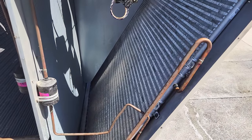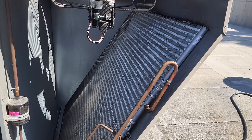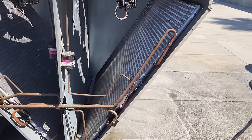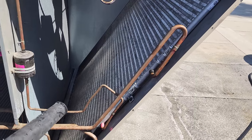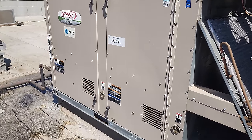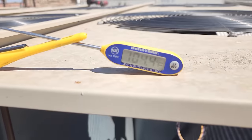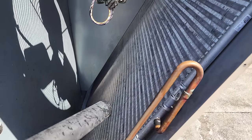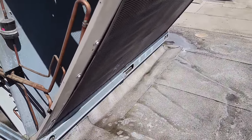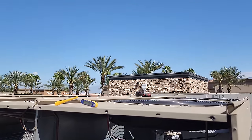Turning the system on with all that water in the coil — it's going to take a while for that water to exit or evaporate. In really hot climates, I've actually seen all that water in the coil trip high head pressure. I know it doesn't make sense, but I've seen it many times. Also, if you turn it on full of water and it still has soap in it, it will literally make a bubble party — start blowing bubbles out the top of the unit and get into the motors. So I'm blowing everything out to speed up the process. It's about 104–105 degrees now.